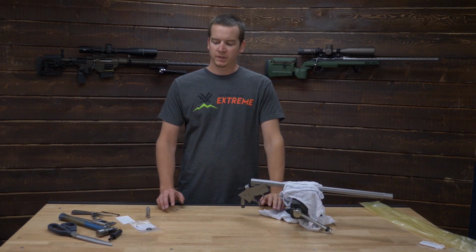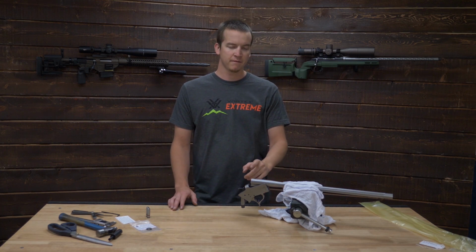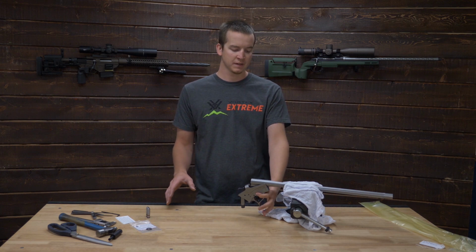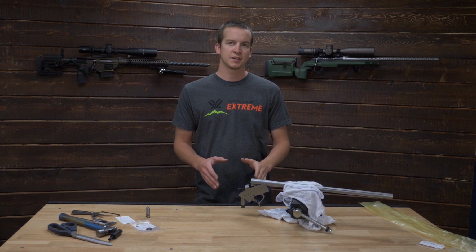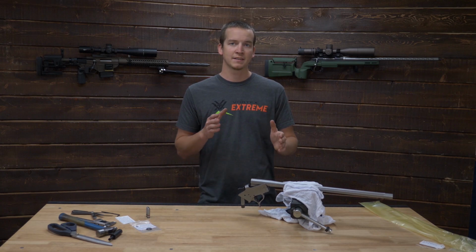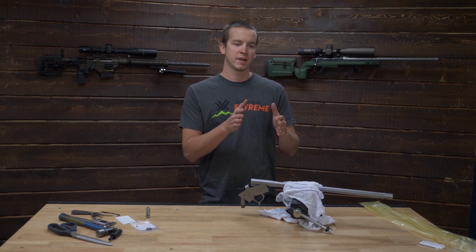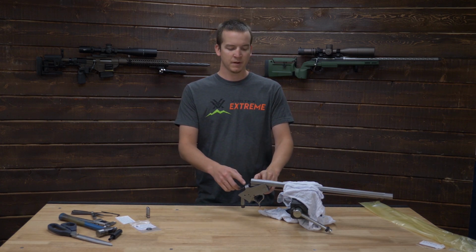So in this video, I'm going to talk about how to put the Bellm bushing kit behind the firing pin bushing in your Encore frame. This will be the same process for the Contender or the Encore. What that does is it essentially changes your barrel to frame gap, and it closes in and reduces headspace. So if you have excessive headspace, it will push that firing pin bushing closer to your barrel, reducing headspace, getting it in spec.